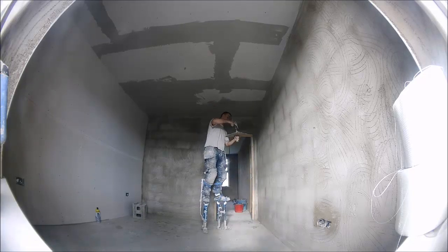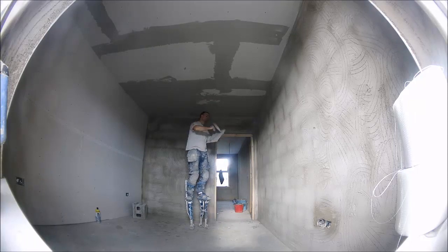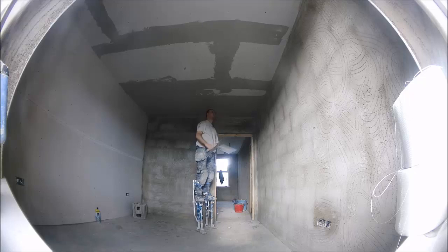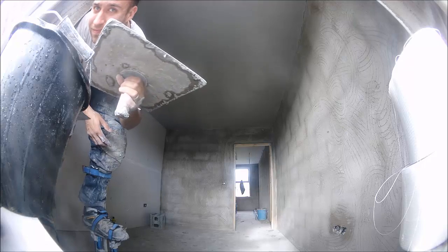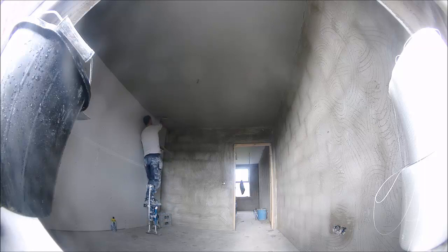This mix would be a tiny bit heavier than for walls. The lighter you mix your stuff the easier it should be to spread, and the thicker it is it'll take a wee bit more muscle — but if it's too light it won't go on quite as neat and you might leave more lines and marks. The trowel I'm using here is well broken in with a nice rounded edge so that it doesn't leave as many marks.